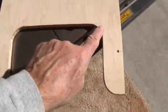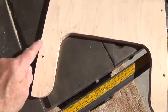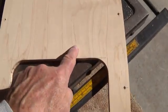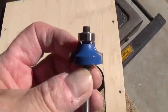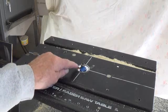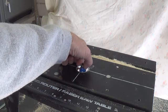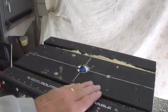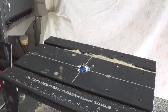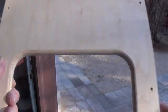Next up, we're going to router this cutout for the back door, which will give it a nice finished look. We're not going to do any other part of it except just the cutout. And since this is half inch, we're going to use a smaller router bit — we're going to go with the one-quarter inch radius bit. Same procedure: with the router unplugged, you change bits and set it up where the bottom edge is even with the top of the table. Run a piece of scrap wood through to make sure you have it set right, and then we're going to router the back door. We can end up with a really nice radius edge on the cutout of the back door.